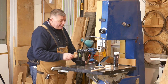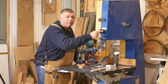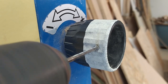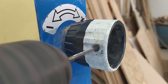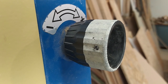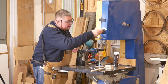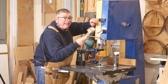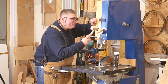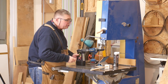And this is what I'm left with. Now, this knob has got 15 ribs and ridges around its circumference, which is handy because it divides nicely into three. So I have drilled a 4mm clearance hole in the knob, followed by a 3mm pilot hole in my plywood disc. The result is I've got a knob that fits in there like that. This is fantastic — I love it. Lovely to use. And then I've just got some screws which hold it in place.